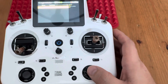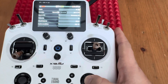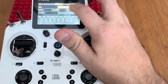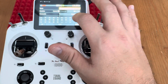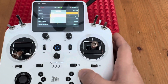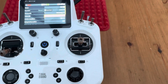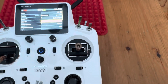You'll want to duplicate this logic switch so that when it gets to zero it doesn't get missed. Long press, choose Clone, then go in and edit it — change the name to something like 're zero.' Now change the condition to 'equals x' and set the value to zero. This will only trigger when the remaining capacity gets down to zero, which is 20% left in your battery — just like vControl does.